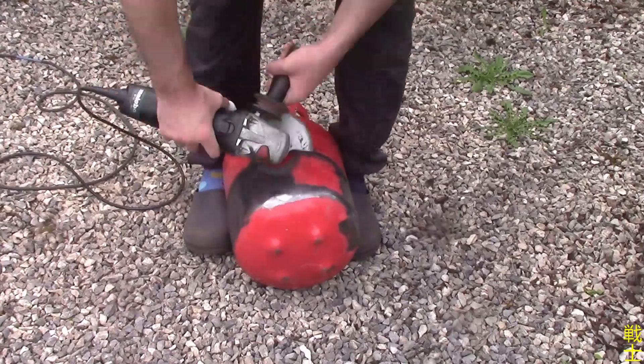To cast a ceiling of the forge, I flip it over, add a pipe with the same diameter as the burner to the holder to act as a space holder, and scoop more of the refractory material in. I again work with the angle irons for the corners and walls, as well as with the burner to set it faster. The heat here is not the main factor in curing it faster — the high concentration of carbon dioxide leads to faster hardening. I remove the space holder pipe very carefully to not damage or crack the material. This is beneficial in the early stages of the curing process, as the refractory will keep its form but is not as brittle when fully cured.